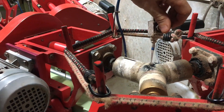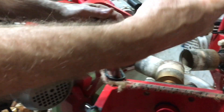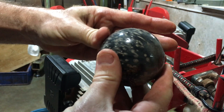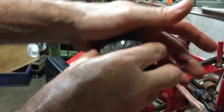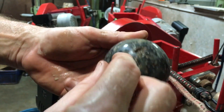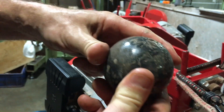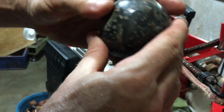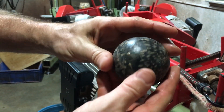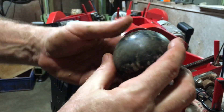Now I can see how we're looking. There's a little tiny bit of a band there, and the other one is cleaned up. So it's almost done at this point in time in rough grind. Now this particular piece has some natural voids in it — we're going to leave those because it doesn't really hurt the stone. Some of the Burmese has pockets that run all the way through, so if you chase the pocket you can end up just getting smaller and smaller. But that's about five minutes of grinding and we're almost perfectly round. Run it for another minute, minute and a half, and it will be done and ready to go to 220.